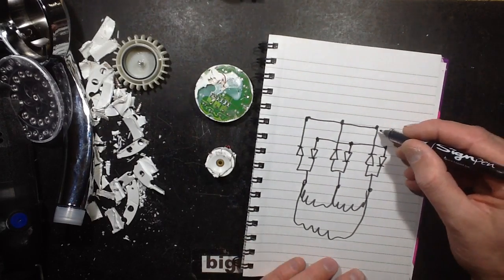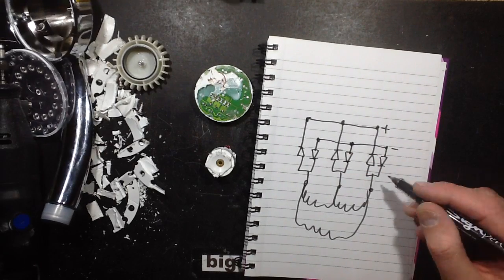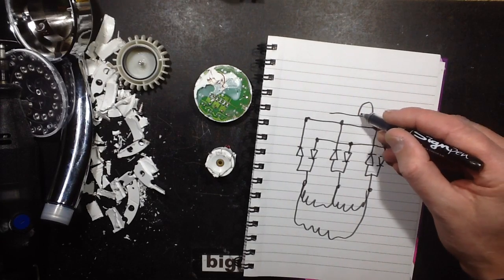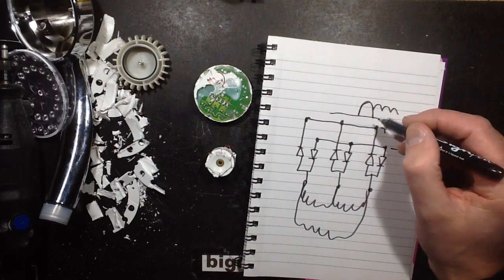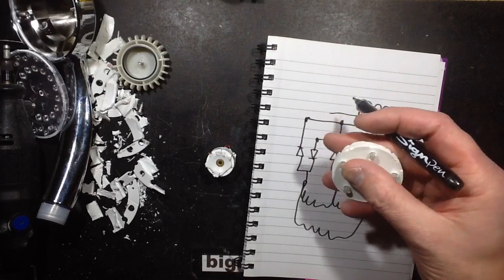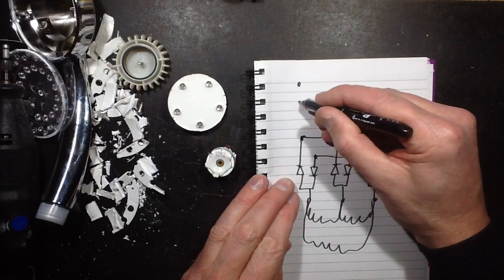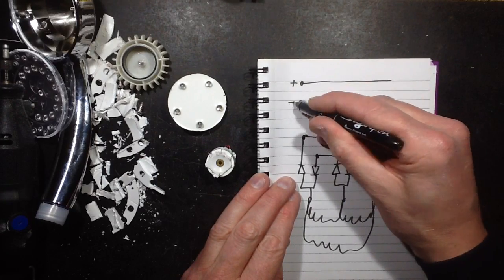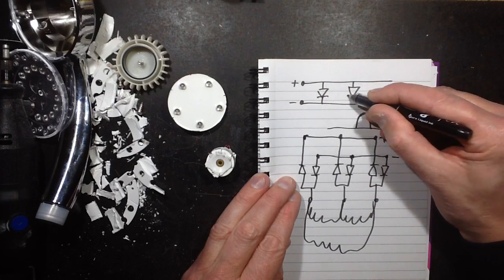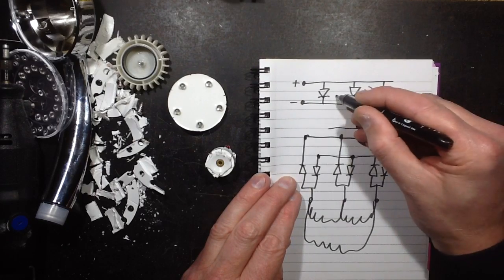So that's positive and that's negative. Because it's three-phase, it doesn't dip right down to zero the way a single-phase would — it sort of bounces a bit. That's what stops the LEDs from losing their color position, because they're the typical LEDs with a wee chip built in that does the color changing itself. After that, it's just positive and negative, and the LEDs are slapped across — whatever current is generated by whatever flow of water, that's as bright as the LEDs go.